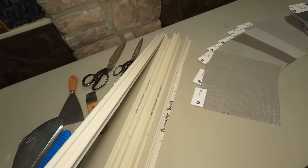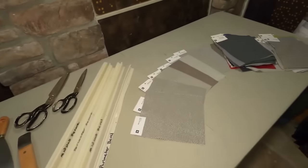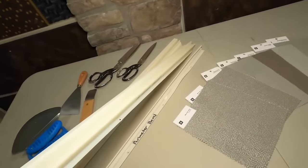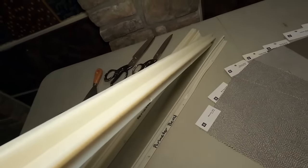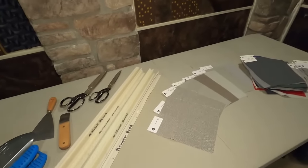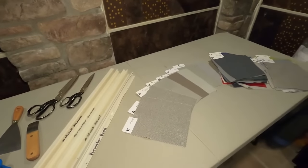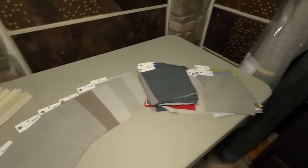It gives you about a 16th to an 8th inch seam down the middle, giving it a nice shadow line and effect. And then if you really wanted to get a little more aggressive, here's a mid-wall bevel. Let's see if I can zoom in on that, but it's got a beveled edge. These are test pieces. This is from Kinetic Noise Control. That's our go-to company for fabric track systems. Again, Guilford of Maine fabric.